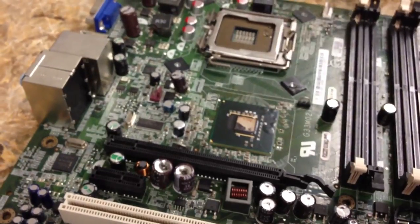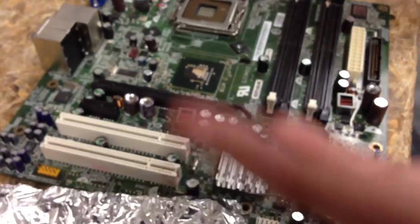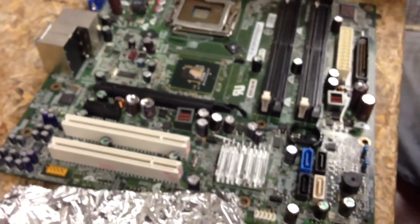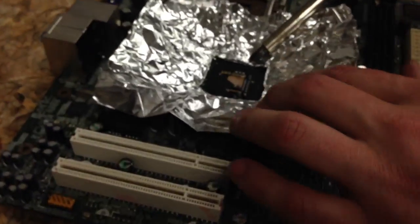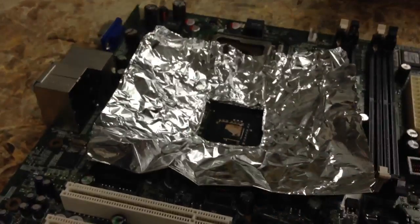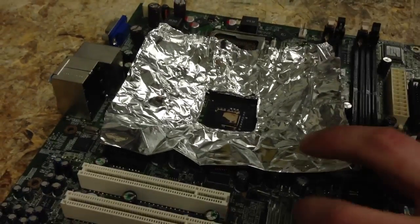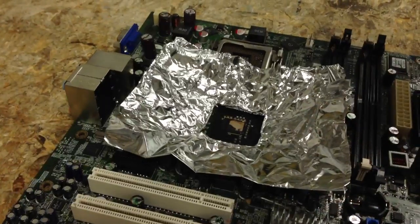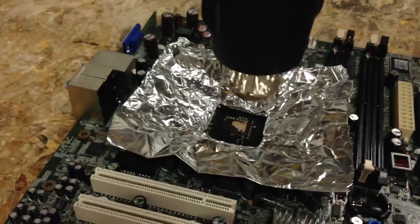Now, I've already preheated the board a bit — it's not quite done yet. You can see the nice arc here; you kind of want it curved up like a basketball almost. We're going to go ahead and heat it up a little bit more. We're using tin foil just to dissipate the heat a little bit — last time we melted some plastic and the customer wasn't happy. I'm going to go ahead and heat it up; it should already be almost done.